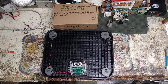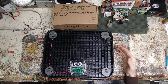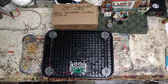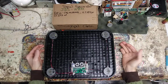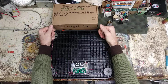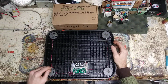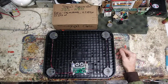Now, these 1, 2, 3, and 4 are what you would call strain gauges. There's 4 of them. Strain gauges or load cells, okay? On most scales, you're going to have 4 because you need 4 legs on the ground. If you only use 2, then you could lean toward the back of it and it's not going to correctly weigh you. So each one of these is a load cell, and I'll actually pop one out and show you as we get rolling.